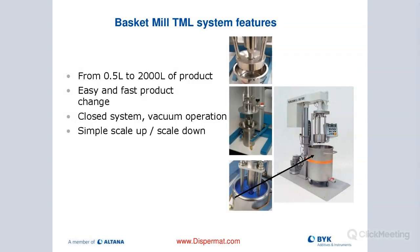We make them at pilot scale and much larger. We also offer a vacuum capability so you can mill under vacuum. The advantage is that removing all the air allows the product to flow better with no foaming. Air bubbles inside the mill base act like tiny air mattresses that buffer the blow of the beads, reducing milling efficiency. If I can remove the air, I have a much more fluidized material, improving milling results and allowing faster and better milling.